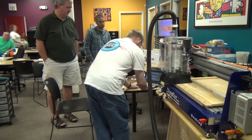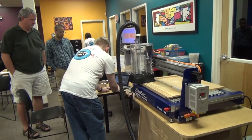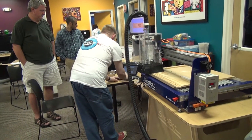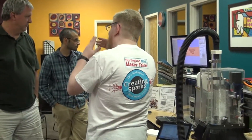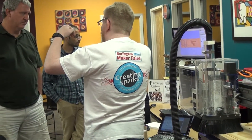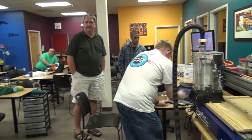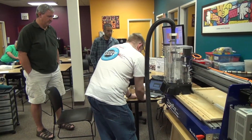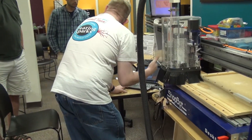This one's in two pieces. The first is the prism cut — that text. Instead of V-carving it down, I'm prism-carving, meaning I'm carving up to the lines of the V-thread. It loads it and it's tool number one in the spindle. It knows the last thing I did yesterday was a flat mill, so it's warning me — I think you might have the wrong tool.